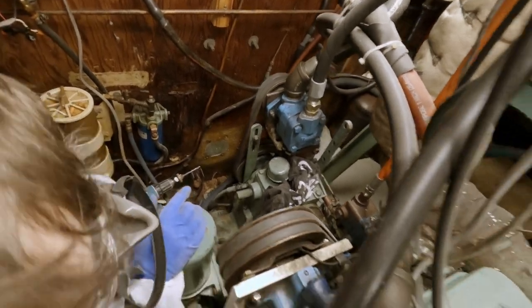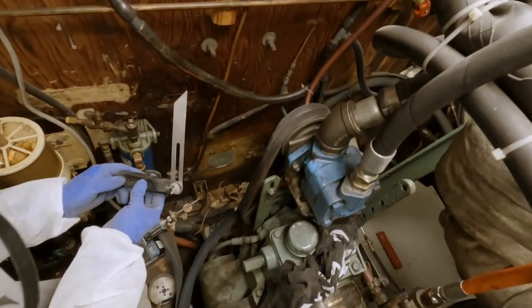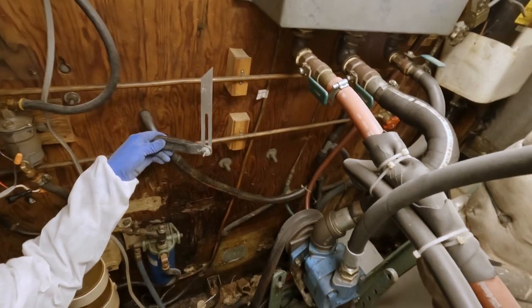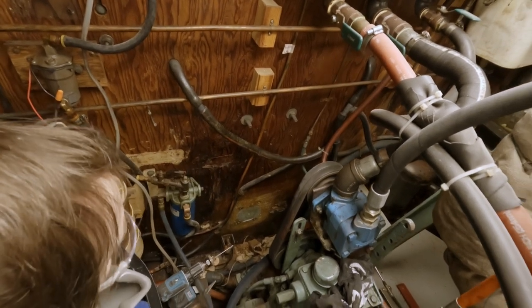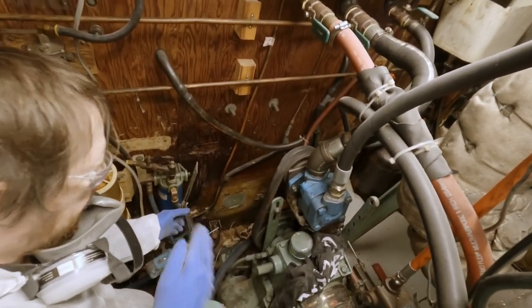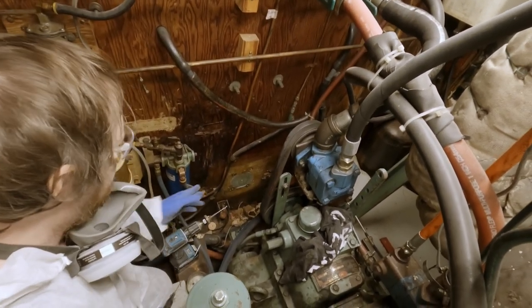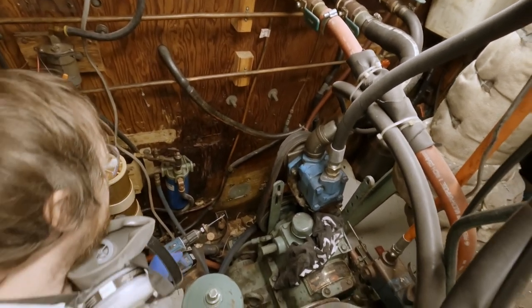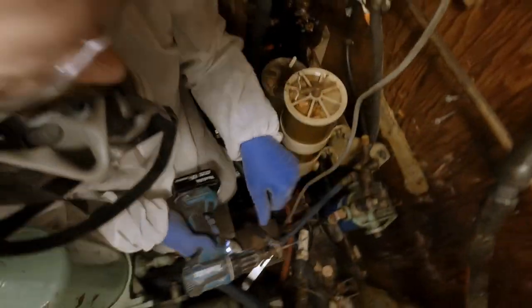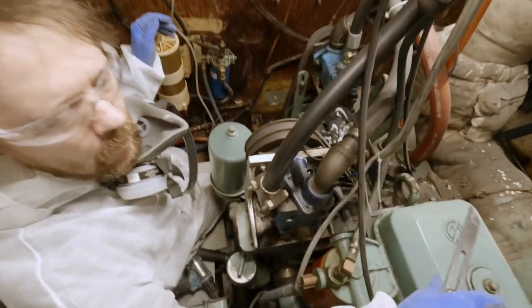Not quite sure what I did with my angle finder - I had it a minute ago on the deck. So yeah, it's just shy of a 90, so I'm just going to use that as a reference to drill my hole. It's about three inches thick now because we added another layer of foam on the backside and the shaft alley. So I want to try and get more or less the correct angle that the shaft will be going penetrating that bulkhead. Just gonna pilot drill it and then we'll try and saw the hole through it.